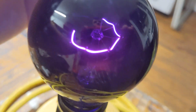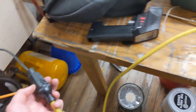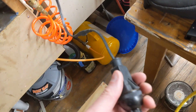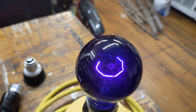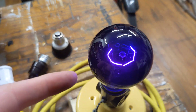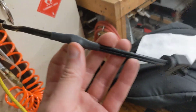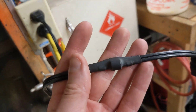But this bulb is designed to take advantage of it. We can see that the glass envelope is extremely dark. This light bulb is 75 watts. I'm only running it at half power to conserve the filament, but let's fire it up to full power for a few seconds. Now we're at full power — it doesn't look much different on camera, but in real life it's a little bit brighter, at 75 watts. The way I was reducing the power is using a cord I built with a diode in it that effectively half-wave rectifies the electricity so that only half of the power gets to the bulb — a very simple light dimmer for incandescent light bulbs.